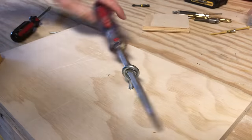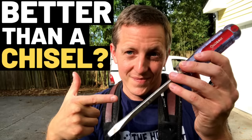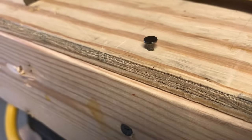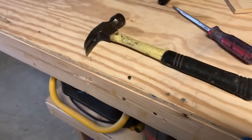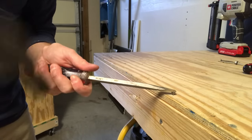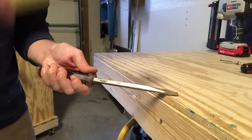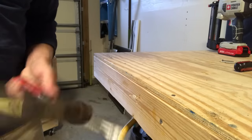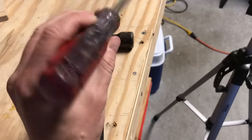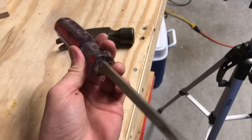Number twenty: use a large screwdriver for offset nailing. You can use these larger screwdrivers to drive down nails that your hammer can't reach. If a nail head is poking out somewhere and needs to be tapped in, lay the flat face of the big screwdriver on it, then carefully strike the bar of the screwdriver with the hammer — you can generate enough force to sink it. This has hundreds of demolition applications as well. These large screwdrivers are indestructible and can reach into areas where other tools can't.